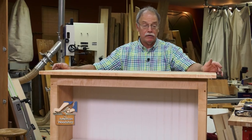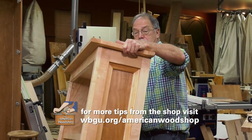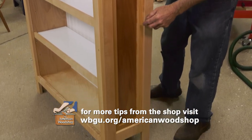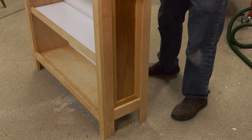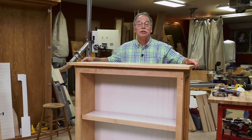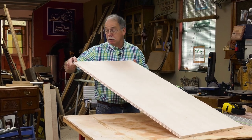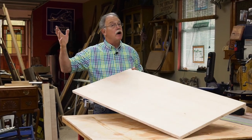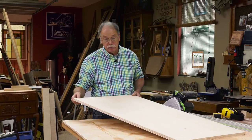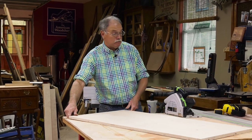The wood makes this project, but look at the trim on this — look at how this is framed out. That's very simple mitered work, and this is birch plywood. You select the grain carefully on that. The bookcase project is built out of three-quarter inch plywood — that's called the case or carcass — and we trim that out with solid hard maple that's just about an inch thick.